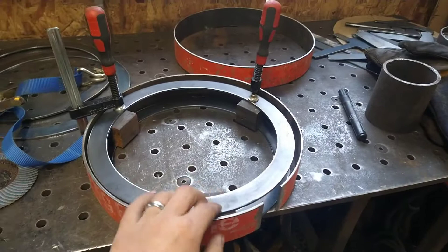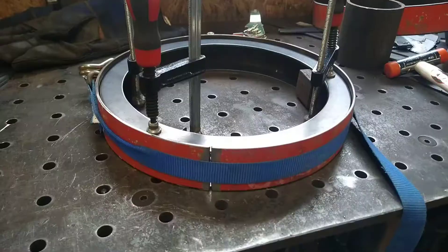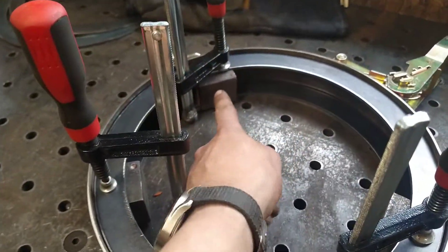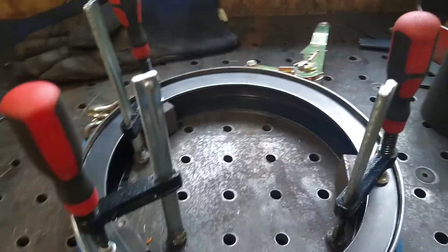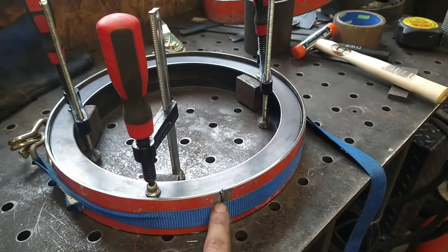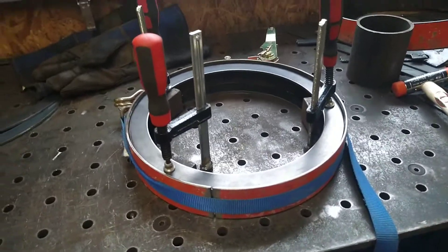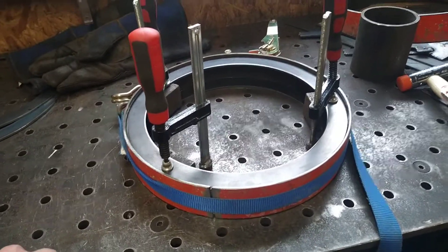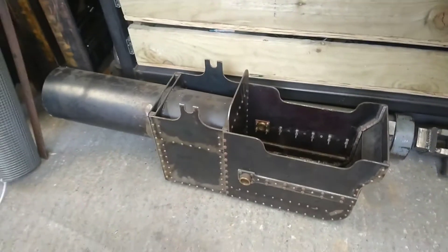Doing all the riveting and that — I'll see where I go. Anyway I'm just doing this now, I'll get you some footage of it once it's done. So we're braced together. I've got these little shims here — well they're fairly big — just to keep these parallel, obviously top and bottom all the way around. Now I should be dead on 12 inches. I'll tack that up and then do the other one, and then I should have some wheels suitable for the little engine.